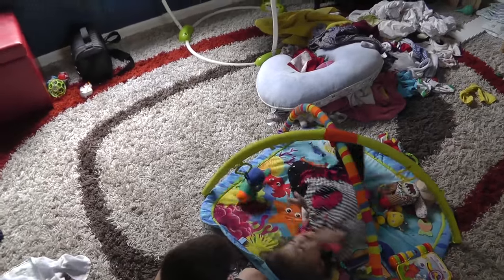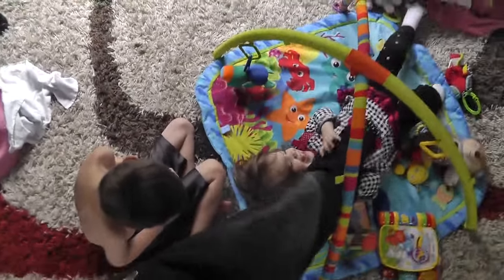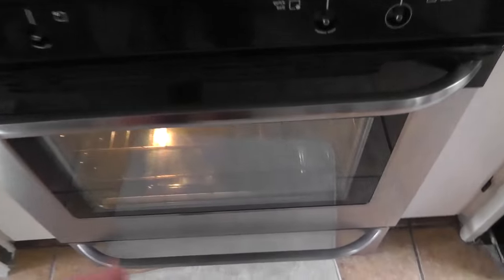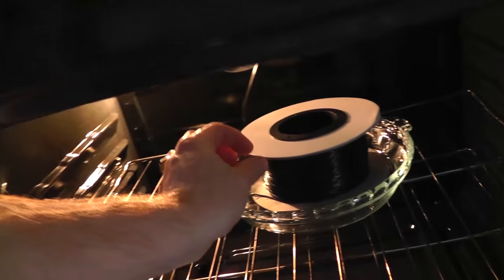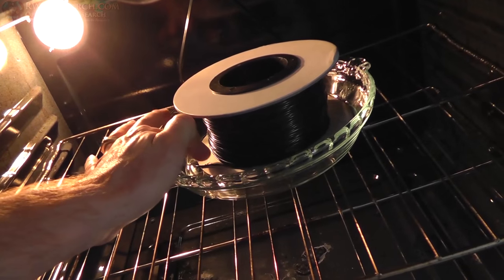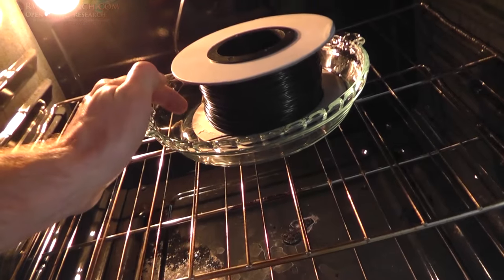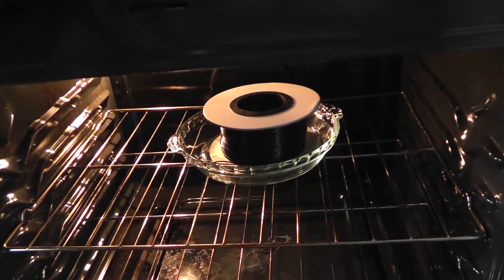Terror — it's a terror. Okay, it's been in there for about 20 minutes and it's getting a little soft. The plastic is getting a little soft, so I'm turning the temperature down. I may take it out to make sure it's not going to mess up the diameter of the filament — that could be bad.